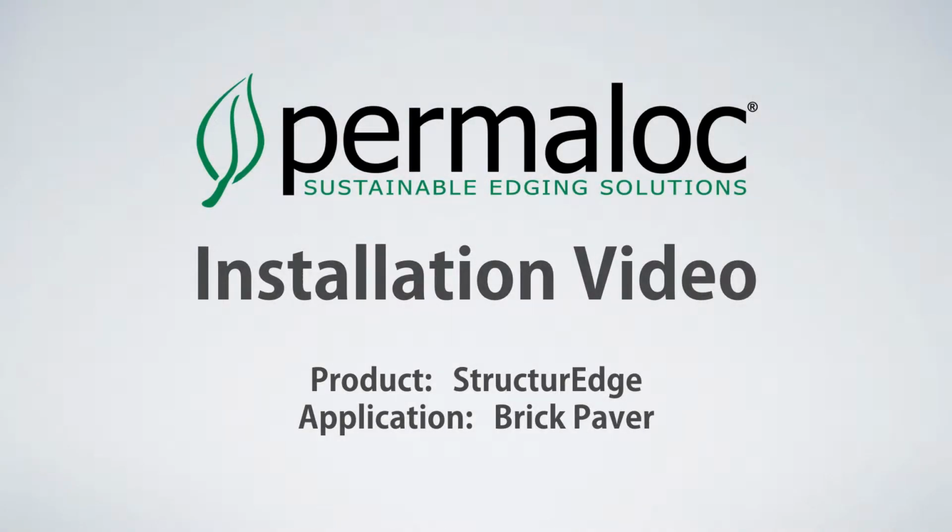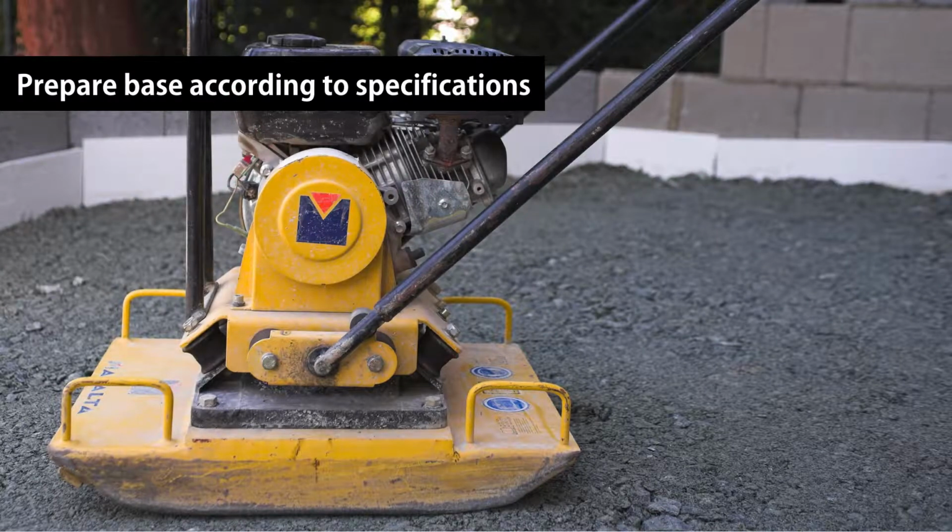Welcome. In this video we will show you how to properly install Permaloc StructurEdge paver restraint. Before you begin the installation of pavers and edging, you must prepare the base according to the specifications, including a compaction of at least 95% proctor density.